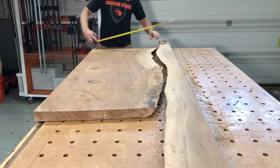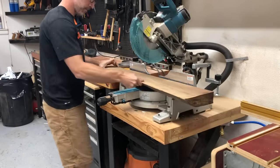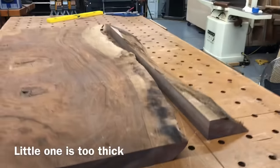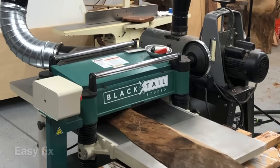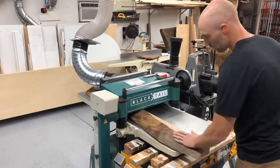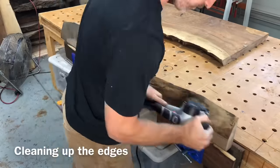This slab really just clicked together. You can see there's really only one way that edge could have landed on that main slab, so this build went together really quickly. The only thing was it was slightly thicker than the main slab, so I just had to give it a few passes on the planer — this is a Grizzly 20-inch planer with a helical head, which is more than enough to remove the material needed on this small piece. You could even use a benchtop planer for a project like this. Overall, it went pretty easy.